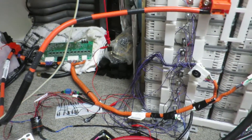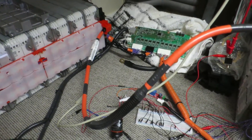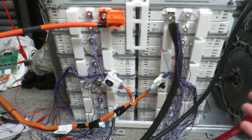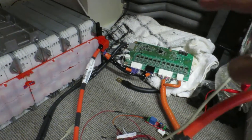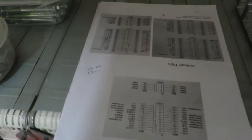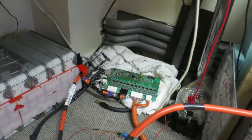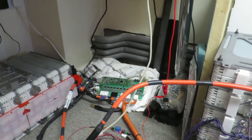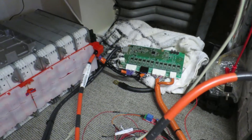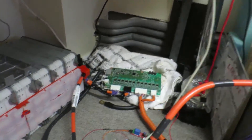Another important bit of information — if you've been watching my previous videos, you'll know that my BMS has a bit of damage on it. Now I've got everything plugged in, I've been able to assess the damage, and I'm pretty happy I should be able to fix it. Three of the cells give a very very low voltage reading, however if I measure the cells with a voltmeter, I get a normal voltage. Which means it's damaged, and I've tracked the actual circuitry on the board — on the damaged part — to the BMS cable, using the wiring diagram I found online. Cell 82, which is showing a low voltage, is wire 82, and cells 81 and 83 which are low are either side of it. Because that one's dead in the middle, both batteries either side are not registering on the BMS correctly. But because it is giving me voltages, I think the main chip is good — I think it's just the resistor and the diode that are faulty. I'm going to get them replaced hopefully even next week, and that will be fully operational.